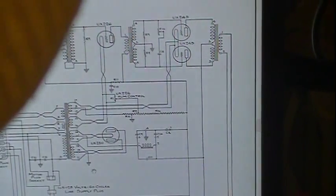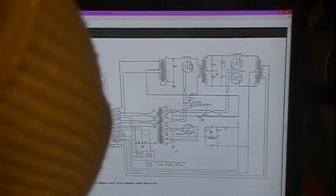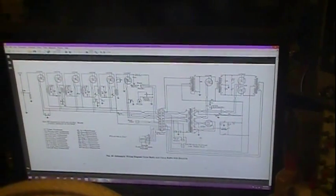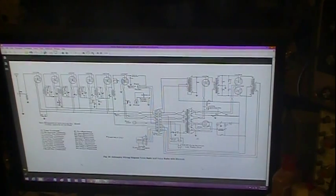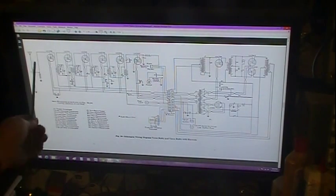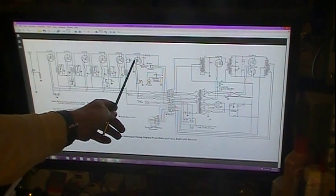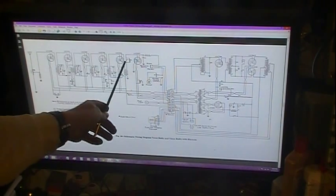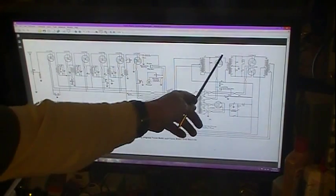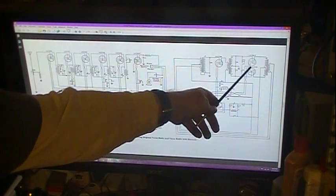let me zoom out so I can show it a little more. I know it's probably kind of small, but bear with me here. Let me rotate you down. I needed 1.5 volts, decent current, for these guys, 2.5 volts for the 27. These are 26s. I need 2.5 volts for the 27. I need 1.5 volts for this 26. And then 2.5 volts for these guys.